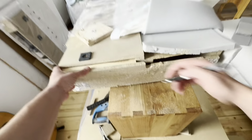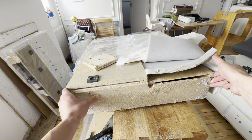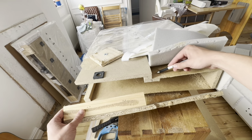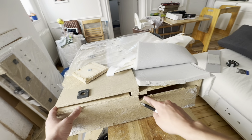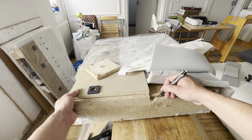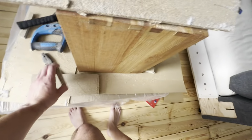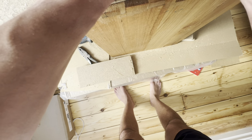wood there. So what that means is essentially you kind of have to just decide which is going to be easier or more difficult for you, whether it's going to be cutting along this piece of wood inside that way and then underneath across here somewhere, just a little bit, 15 mil essentially, to accommodate this, or, because there's always two ways to do something, hold this up in position, make a mark where the wood is conflicting, and again this will only be 15 mil deep. We'd have to really guess. We can just get a piece of leftover, line it up with the edge,